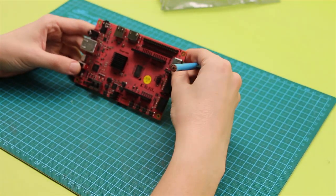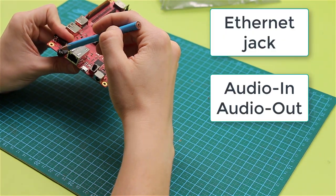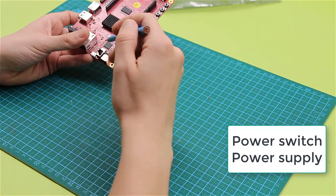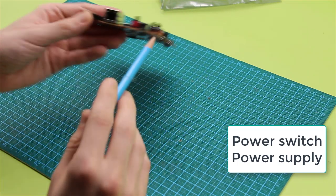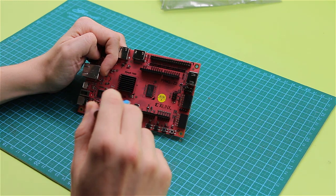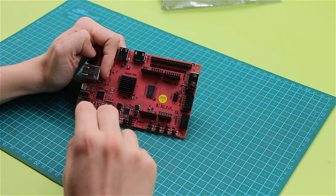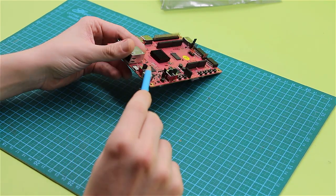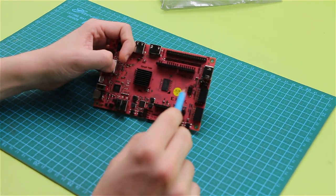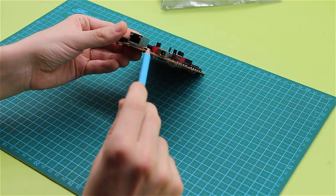What can we see here? First of all, we can see the Ethernet jack. Then there is audio in and audio out. Next is the power switch and the power supply. The board can be powered from micro USB, and there is also a jumper on board that switches between powering from USB and a DC barrel jack. You only use the DC barrel jack if you have more power-hungry applications or devices connected to the board. Normally, micro USB is enough.